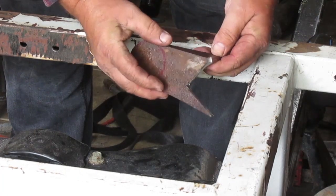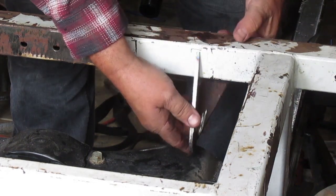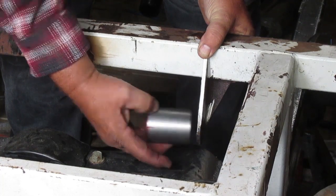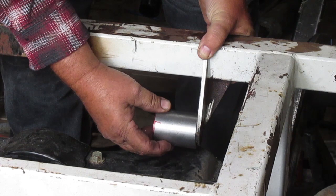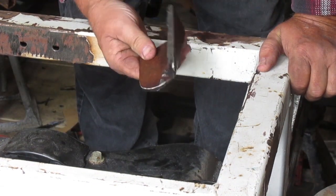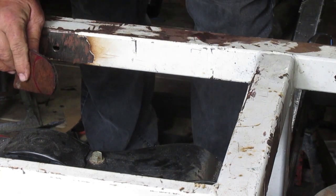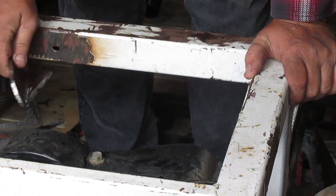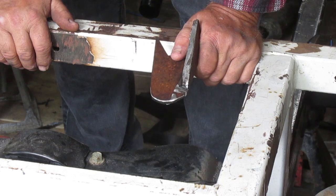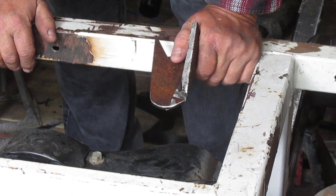All right, here we go. I used the angle on the channel and all this beef in here to make a really nice gusset. Now this is going to fit in just like that — look at that, that fits nicely. This will fit right there and the other half will weld down to that, and we will be right where we need to be. So now I need to make one more of these left-hand ones and two right-hand ones, because with this gusset sticking off it's got to go the right direction. Then we'll weld them all in here and here to get this rear end done. I need to clamp this one down to the piece of channel iron, trace it out, and make the mirror image. And then I can make the other mirror image off of that one.